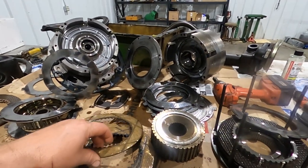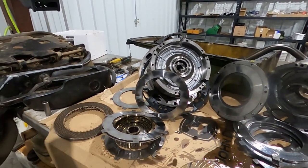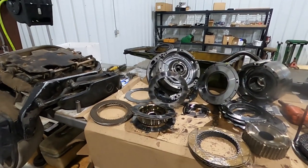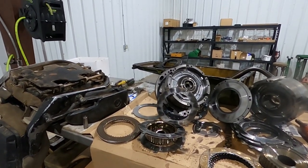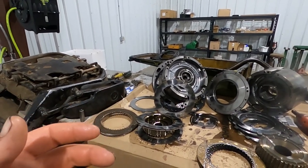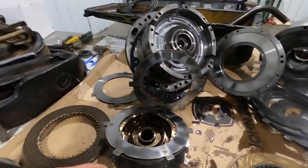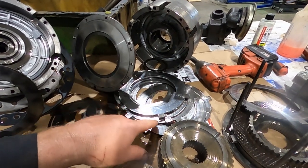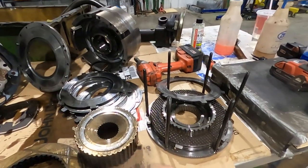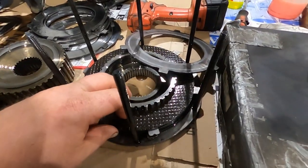It was part of the deal of selling the 4640 — one fall, the other fall, these had slipped quite a bit. Every time I was hauling wagons and hit a hill in eighth gear, I'd give it some throttle, the engine would rev up, so I'd pull the throttle back and shift to seventh, climb the hill, and catch eighth again at the top. This one everything looks really good, and PTO is gorgeous — there's no reason for any issue whatsoever. Everything in the PTO looks brand new.